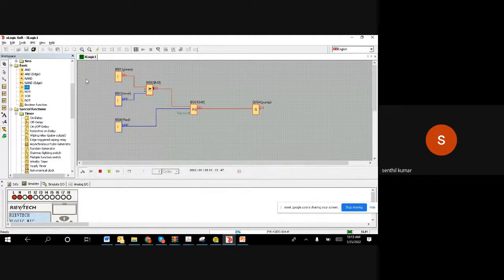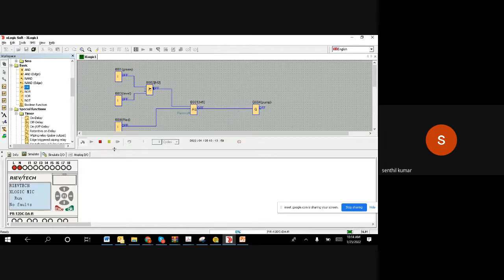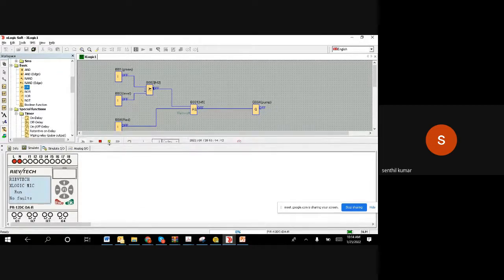This is a simulation. So I'll go for off, right? Now the motor is not running. So what we are going to do is we are going to simulate the input. Let us visualize what happens. I slightly move it up, right? Now I am pushing the start and releasing it. So one time push and release the green color button. See, the Q4 is on, motor is on. And we are coming for the red color stop button, pushing and releasing. I pushed and released, motor gone off.